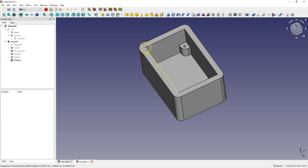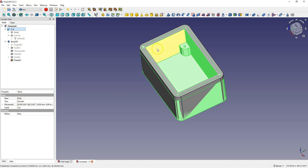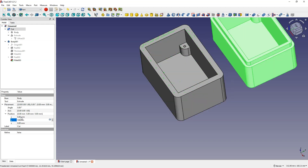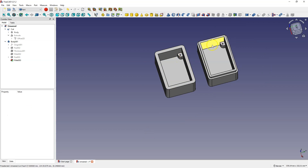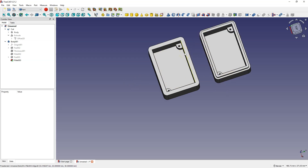I may have been a little hasty when adding these additional elements. It would be better to do it after adding the undercut, because if we make the second part of the box from this part, then after assembling the two boxes these fasteners will not fit into each other. But it doesn't matter much. If we created these elements in each corner there would be no problem, or we could add such elements after adding the undercut. If you are going to design such boxes, pay attention to placing these fastening elements properly.